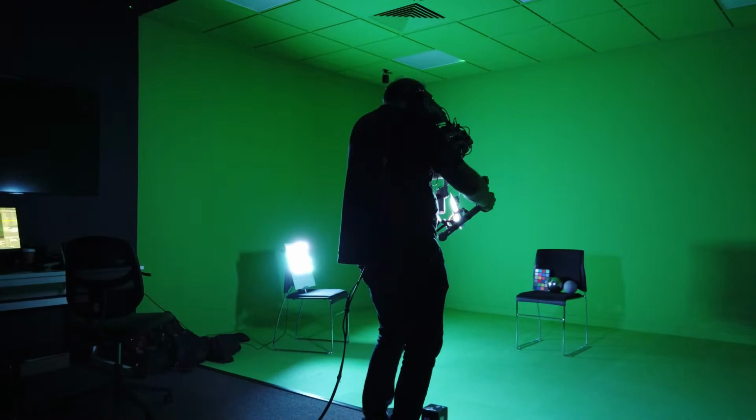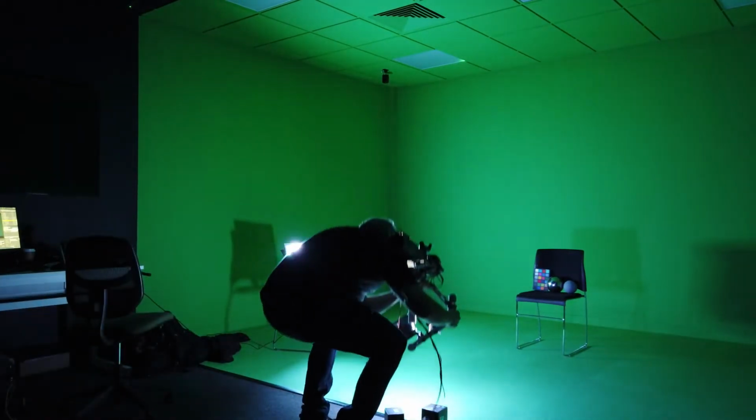But we have to look at that, identify exactly why that failed. A lot of this comes down to material properties. Resin is notorious for being a little bit brittle, so therefore when I was putting it under some rigorous testing and strain and stuff, it just didn't really cope with it. And there are other things on here as well that broke. So here's another one. This broke in the testing process, and it's just the shoulder mount adapter. Too thin, too much strain, and it snapped pretty clean off.